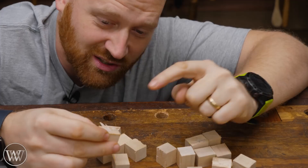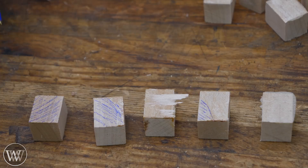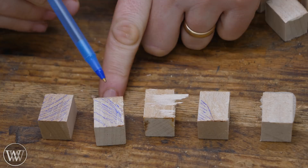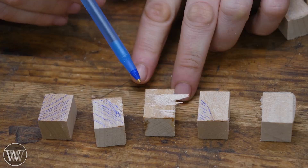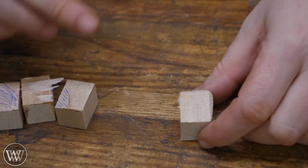But I can't always make it 100% perfect. Sometimes the glue shears off nicely and sometimes it takes some wood with it. So in some of these cases, like this one, there's 100% shear off — the wood broke 100% of the length. In this one there was a corner, so it was about 75% wood broke and 25% glue. This one was about 50-50 — you can see the chunks of wood that are left on here, but there are large chunks where the glue failed. So this one is about 50%, this one's about 25%. The vast majority of them broke right on the glue line, so it's the glue that broke.